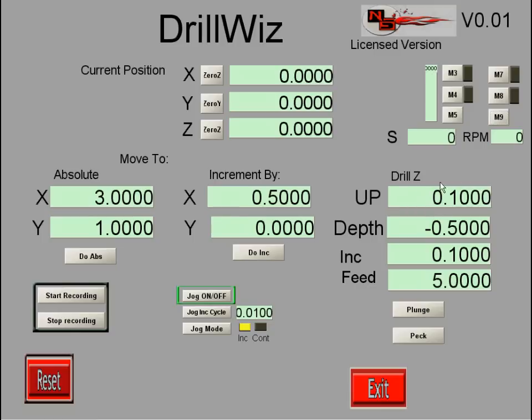If I'm going to do some drilling, I'd start by setting up my drill values. "Up" is the high rapid traverse above the work — probably a positive number. "Depth" is the depth I'm going to drill the hole to — in this case, half an inch. "Increment," if I'm using a peck drilling cycle, is the increment for each peck. "Feed" is the feed rate of the drill plunging down — not XY movements, but the drill feeding speed.